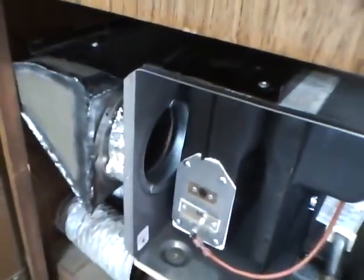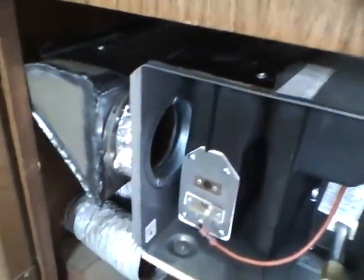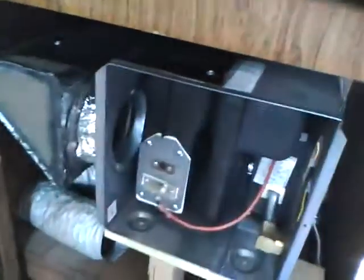And hopefully the extra square inches will help take care of that little bit of restriction there, so this thing shouldn't get bogged up, because the cold air intake for the heating section is back here. Hopefully the hot air coming out of here won't recirculate right back into there, because that'll trip the high limit switch and shut the furnace off. If it does, I'll have to build some kind of baffle or just go crazy with the aluminum tape on this. And your standard wiring connections.